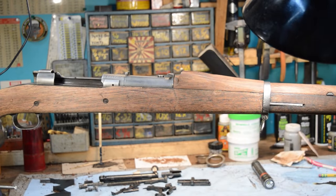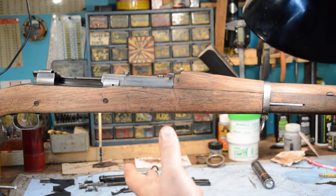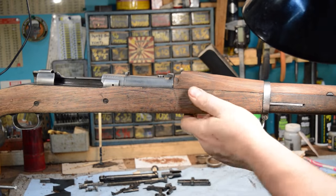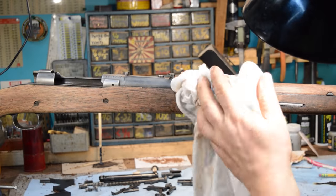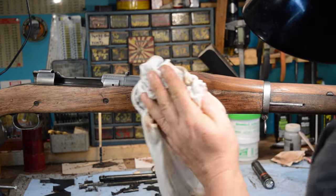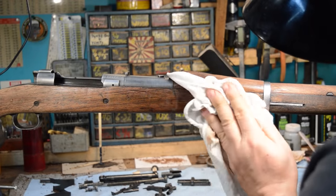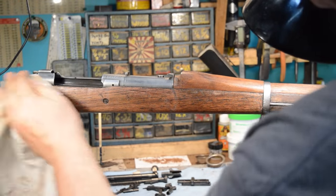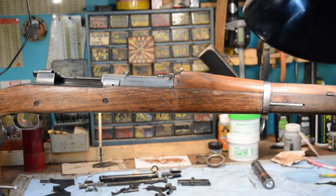So, stains. A lot of these earlier 03s, the Garands, had kind of a reddish stain, and I'm going to go dark. If you want to see what a gun's going to look like blonde, just get it wet like I did on that 94 reveal. If you get it wet, that's the color it would be if we just put any kind of oil, linseed oil, or in my particular case, a Danish oil. That's the color it would be. And that's not nearly dark enough. I want to take it dark enough to hide this entire plethora of issues. And the other deal is that as stock finishes age, they get darker.